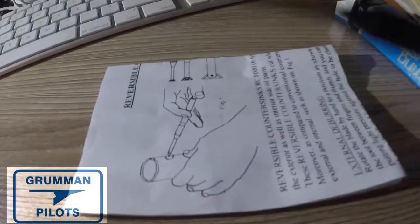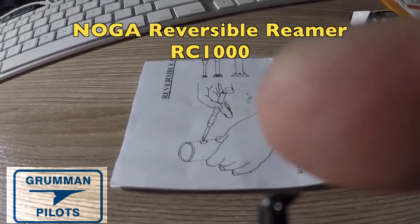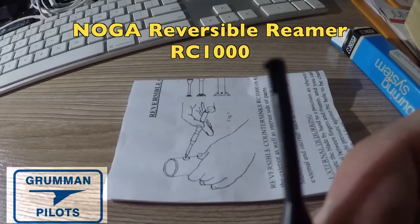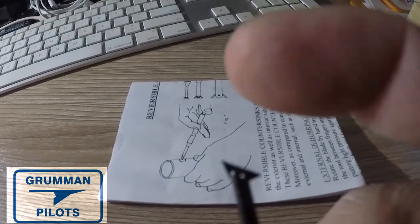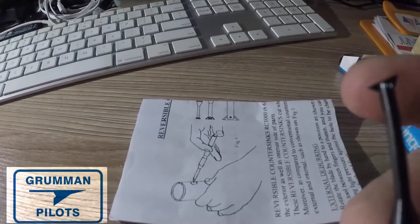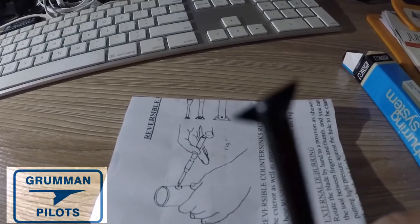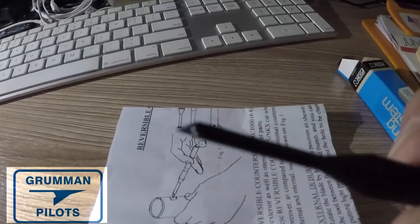We also have a little Noga — it's a reversible deburring tool. It goes inside of a hole and a piece of pipe or tubing so that you can get the hole from the other side. It works both in normal holes and those done on circles, making it a nice tool to reach those hard-to-get deeper spots when doing riveting on our airplane.